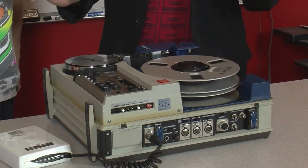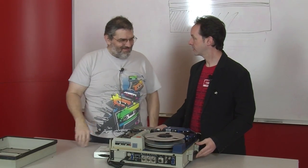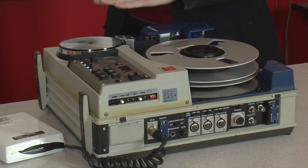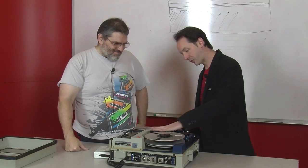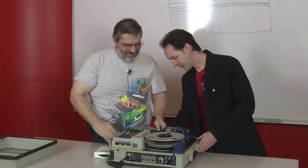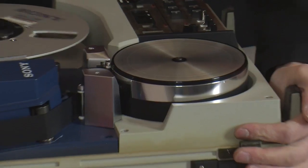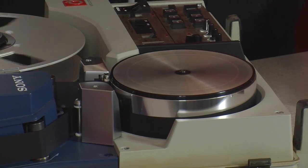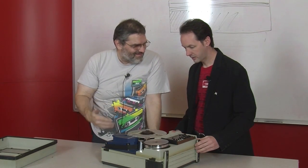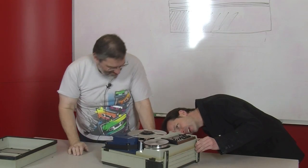People can't play with these things — god forbid. The whole mechanism for sucking the tape out of a VCR cassette to put it around the drum solves the loading problem. Here they solve the angular feed across the heads by just stacking them — you come in low and go out high. I can see the tape coming in at the bottom is slightly overlapping the tape at the top. The head is actually at a slight angle — it's not vertical. That's subtle, but that's why they call it helical scan. We ran out of tape, I think — let's hit rewind.